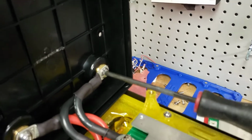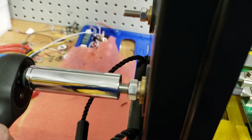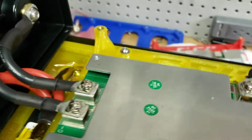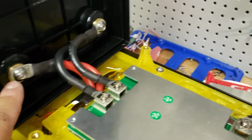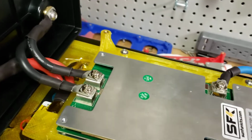What this allows you to do is you can tighten the bolts this way, and then using a socket wrench on the other side, just hold it in place so that you can do that. The goal is to make sure this is a very tight, snug fit. Make sure you have some Loctite in there, and for the most part, when you're done, this should be good.